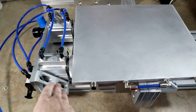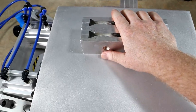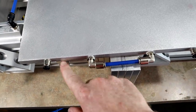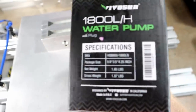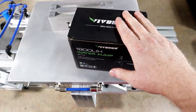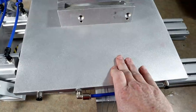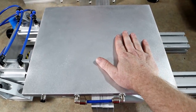These chill plates run water into a piece of aluminum that gets clamped in between your molds to cool them down as you go, decreasing the amount of time between injection runs. This one he made custom for me - it's huge, meant for my open pours. Whenever I'm taking my open pours off the griddle and the molds are super hot, you want to cool them down as quickly as possible without making the plastic draw in. Now I have a huge aluminum plate that will draw the heat out, and I can run water through it using a water pump - fill up a five-gallon bucket, chill the water with ice or just room temperature, and run it through the plate.